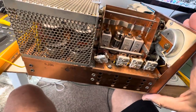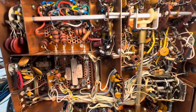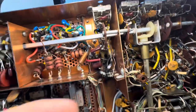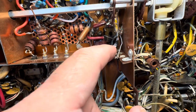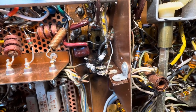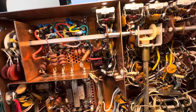When that shorts out it causes all sorts of problems with the B+ resistor, which you can see here — it's smoked to hell and back. So I guess when I was fixing this thing when I got it from eBay and it was a basket case, I didn't really find the short. I thought this wire was shorting so I put heat shrink on it — this yellow one here, the same yellow rot stuff. But nope, it was a more nefarious wire deep in there. I opened this thing up today and I find these are all burned up. These are the B+ resistors, so I'm working backwards, trying to figure out why these blued. I could see on the meter there was a short that came and went, so that is what I'm doing — back-tracing that.